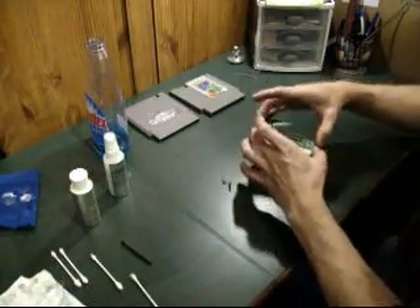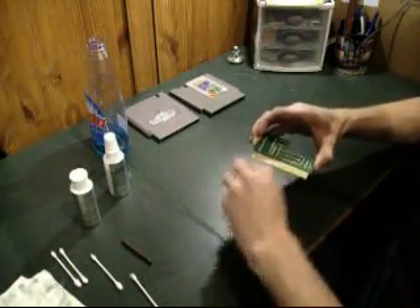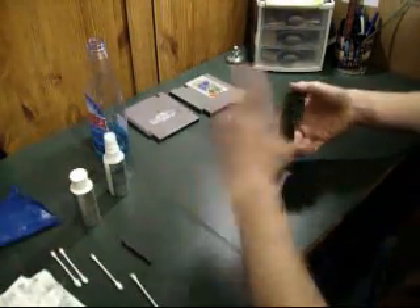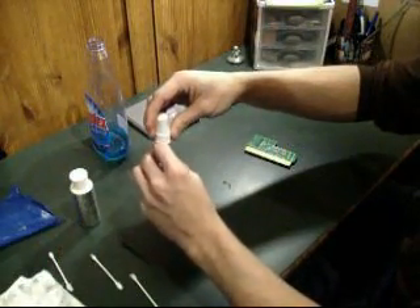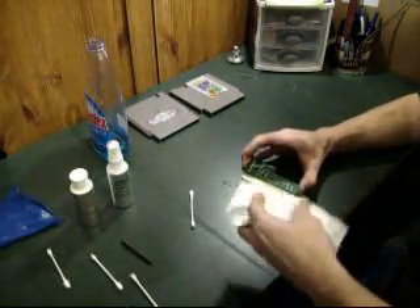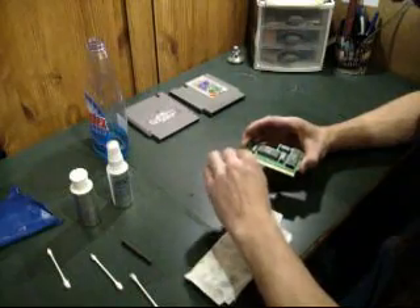So now we're going to take our board here. We're going to take our cotton cloth and we're just going to wipe that paste off. If you're just using rubbing alcohol or something like that, you won't have this step because you'll just be rubbing those contacts with the alcohol and cleaning them off as you go. Now we're going to take the finishing spray and we're just going to put some of it on a Q-tip. This just kind of gets rid of any residue that's left by your cleaning paste and whatnot. We're going to use a non-static rag — no point in using a non-static finishing spray if you're going to use a static rag. So we'll just clean that off there.